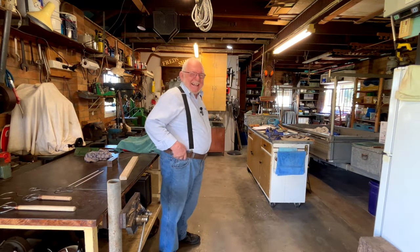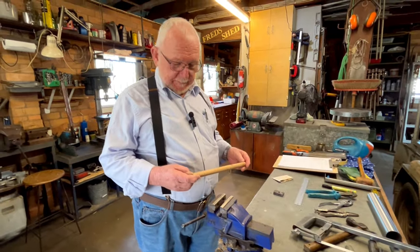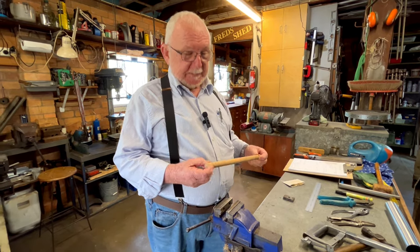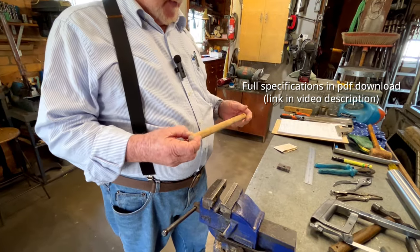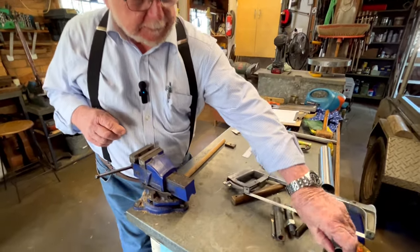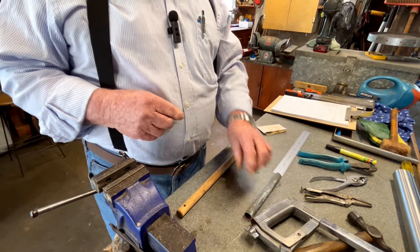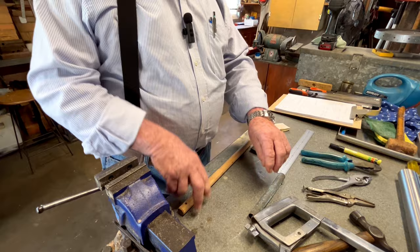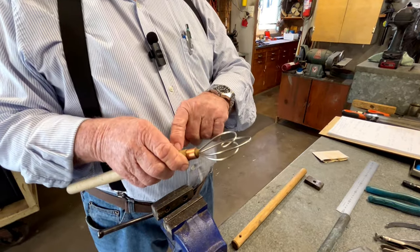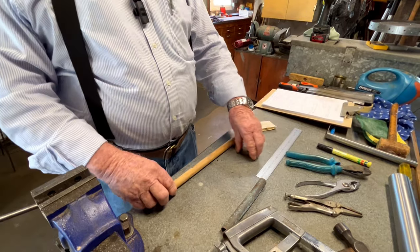Welcome to the shed. The first thing to do is make the handle and I'm using all basic materials you should be able to buy at any hardware store. The wooden handle is basically just three-quarter inch dowel, or 20 millimetre, and you need a bit about 12 inches or 300mm long. The ferrule that makes sure the handle doesn't split is a piece of old three-quarter inch copper water pipe. The ferrule is the bit that goes around the top - its purpose is, when you're putting pressure on this, it'll split the wood if you haven't got that band to hold it all together.